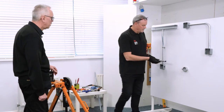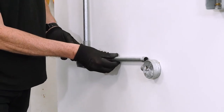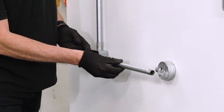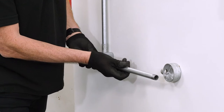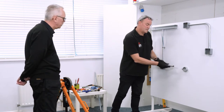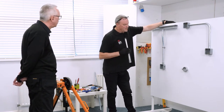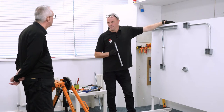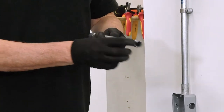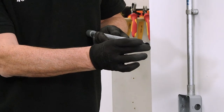Here, as before, we could just slide this down and put the bush on, but unfortunately at this — what we call a stop end box, which already has a threaded spout — we can't just do that. This actually has to be threaded in. Sometimes you'll have a piece of equipment which cannot be moved. So we do what's called a running coupling. We will manufacture a piece of thread here with a coupling that will actually move along the conduit.